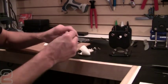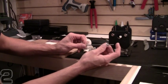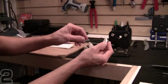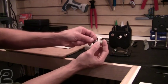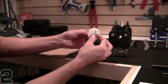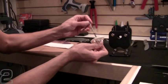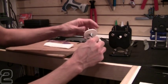Mounting a spinner uses the same concept. You're going to use the stationary back collar and run your centering cone up against it, then run that into the back plate of the spinner. In this particular situation, the spinner is so thin and its diameter so large that if I ran the two cones toward one another, they would hit — so no amount of spring tension would keep the spinner solid on the arbor. We're going to run the second cone backwards to give it a backing. The first one keeps it centered on the arbor. We'll run our compression spring, washer, and fuel tubing up against that. With ample pressure against the spring, the cone centers right in and the back plate is very solid.